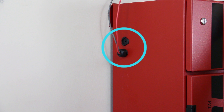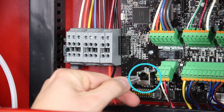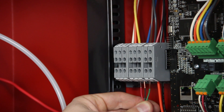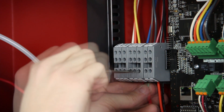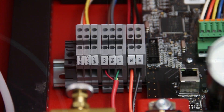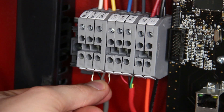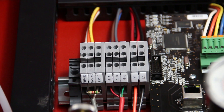For optional internet connectivity, wire Ethernet cable using a 1/2-inch knockout on the left side of the cabinet to the Ethernet port on the Intelligent Controller on the inside of the nitrogen cabinet. If an Intellipurge nitrogen purge valve is being used, wire 3-wire cable to the appropriate P-Link terminal blocks next to the controller using the 3/4-inch knockout on the left side of the cabinet. Using the same 3/4-inch knockout, a Form C relay is available to wire any building management system to the BMS terminal blocks.